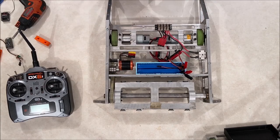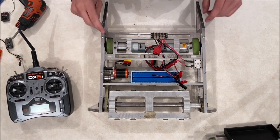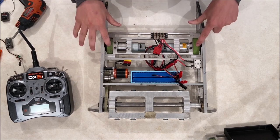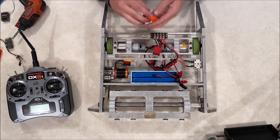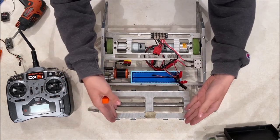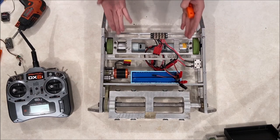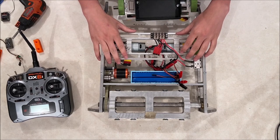There were a few times we'd hit someone and it would cause our bushings to bind up, basically making our weapon useless for the rest of the fight. The third biggest issue was traction. We would try to spin our wheels to move and we just couldn't — the wheels would spin but the robot wouldn't go. The reason was we have almost no weight over the back drive wheels. The front skids have a very large surface area, and all the weight of the battery and the heavy weapon — probably about a third of the robot's entire weight — was over those skids, creating too much static friction for the back wheels to overcome.